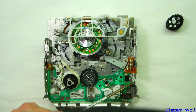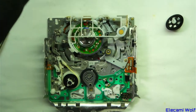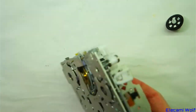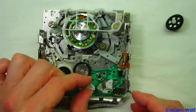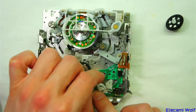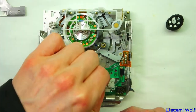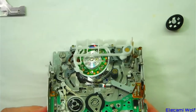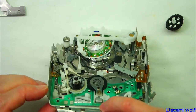Here are some more parts of what I think is the switch — another one of those little pieces which would have been poking up as a little switch for detecting the type of tape. Now there's the back tension band around there, which has been pulled tight. That's fallen off — that's part of a brake mechanism. So that stuff gets retained by that thing we removed.